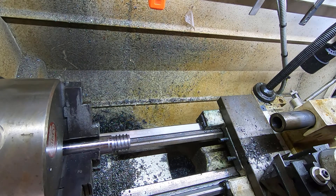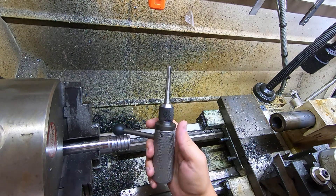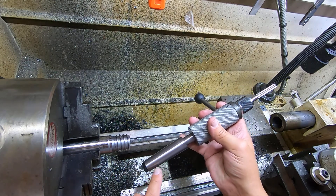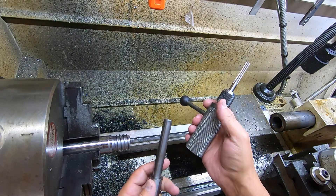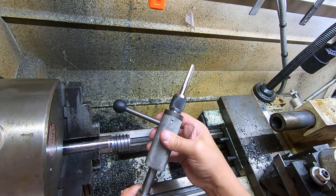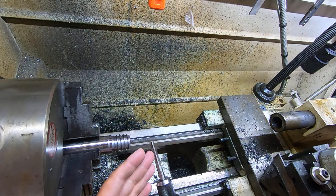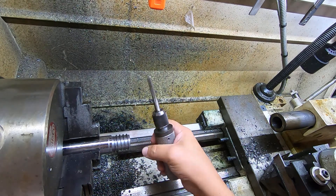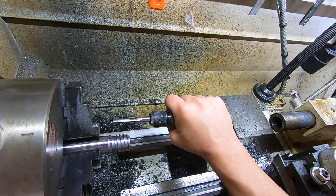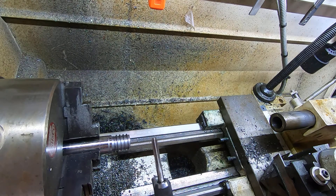That's the main thing of this video — I want to show this tapping tool that I made years ago. I think I've got a video explaining it in better detail, but basically you've got an MT3 tapered shaft here with a smooth shaft that slides into this tool, allowing it to slide back and forth. It's a precise fit, not a lot of slop. I did make it so you can screw this handle in, and if you're tapping things about quarter inch and less, you can just hold on to the knurled part here. Whenever it hits bottom or gets too tight, it just starts spinning in your hand.